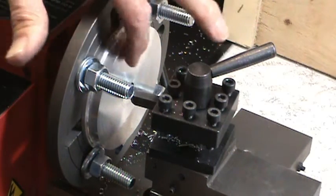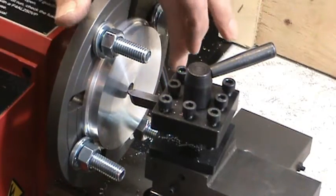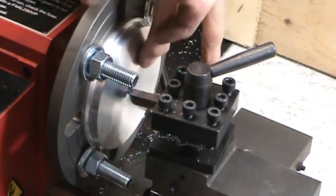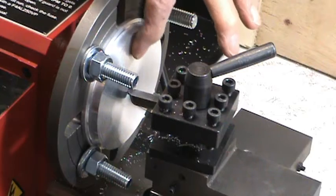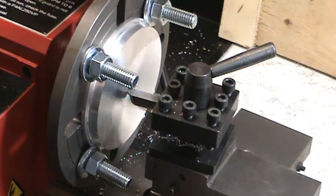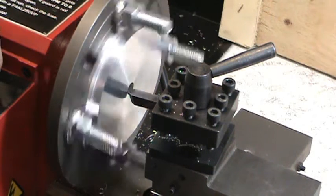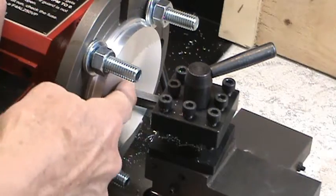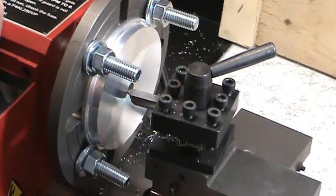So I'm gonna finish facing this off. It's not quite square with the flat back — you can see it there. There's the part that I did and the part that the cutter didn't get, and that's just runout between the front and the back. Another thing: the way this is set up now, with the tool angled, I can get all the way out to the edge without hitting the nuts on the clamps. So that works out really good too.